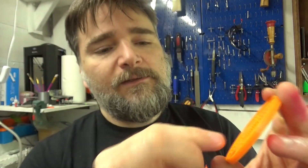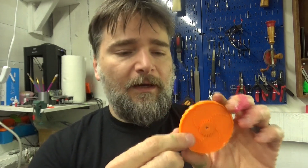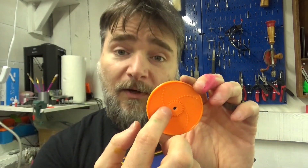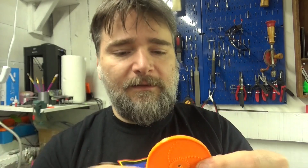One of the teeth did break off, so I want to make the teeth a little bit thicker. But so far this is showing a lot of promise and I'm so happy it's working. The next steps are to eventually take a MIDI file and translate that into peg positions. I'm using OpenSCAD to place the pegs — I've got a module that takes in which note, from inner to outer ring there are eight notes, and a zero-to-one number representing the degrees around the axis, multiplied by 360. There's a bit of fiddliness: the innermost note has fewer valid positions than the outermost because the circumference is smaller, but I think it's all doable.